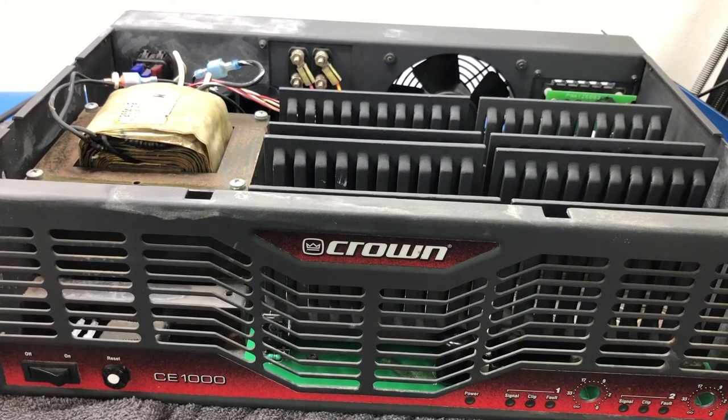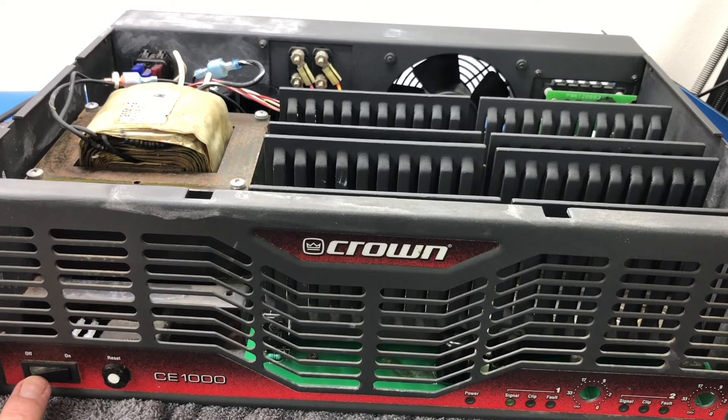So I've taken the dimbulb tester out. Because if it's trying to start, it hasn't got enough power through the dimbulb tester, it could be causing it to go through that cycling condition that we're seeing. Now we'll see what happens. Okay.